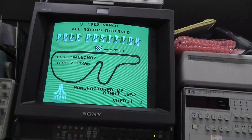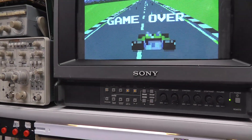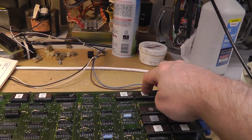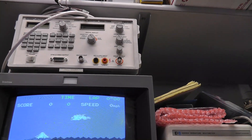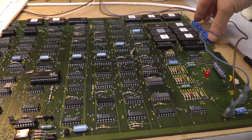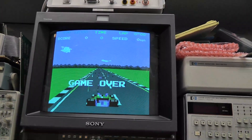We got an image! The colors look off and we're booting, but the colors are off. That could be this color prom right here. I'm pressing on it - we got some graphic issues with the small cars, which in the last video were one of these two ROMs here. Something's going on because when I went to black and white it's totally jacked up. But the good news is our CPU board is booting and these problems look like they're on the video board.